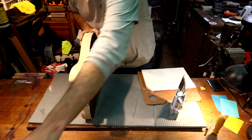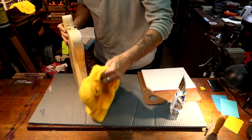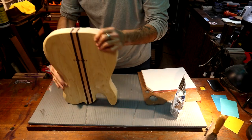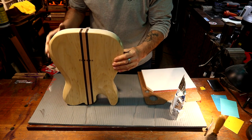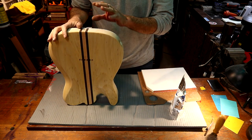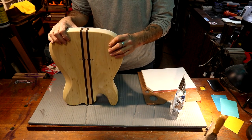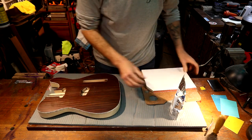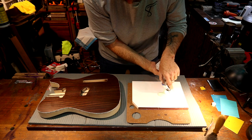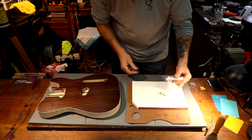Before we get to that, I want to make sure I'm clean and sanded to the level I want to be. Once the putty goes on, I'm going to wipe the entire side to make sure I don't get any grain bleed through my paint. Our first order of business is to fill this grain, let that dry, then sand the sides and back up to 360. I'm going to mix small batches of this stuff at a time because it cures pretty quickly. Very, very little hardener — that's more than enough.